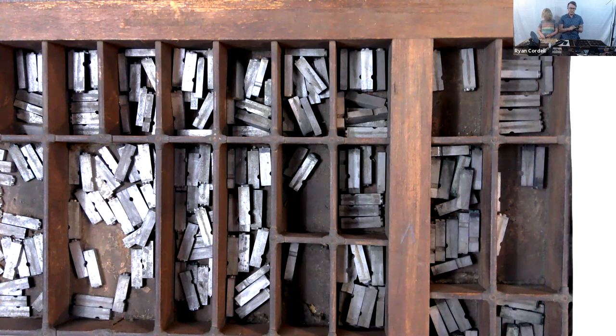Then you had the press operators. That varied depending on what kind of press you're talking about — we'll mostly be thinking about early modern presses. With an English common press, prior to the 18th century, it was a multi-person operation just to run the press: one person to put the paper on, one to apply the ink, one to close it down, and another to pull the press.